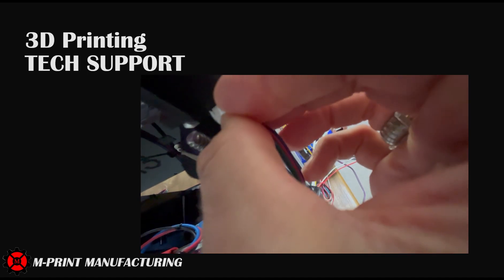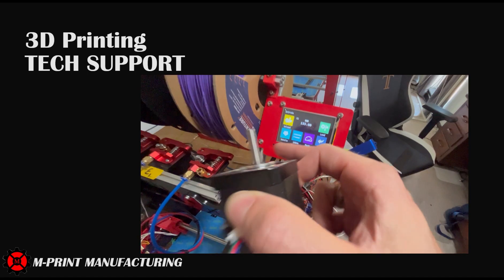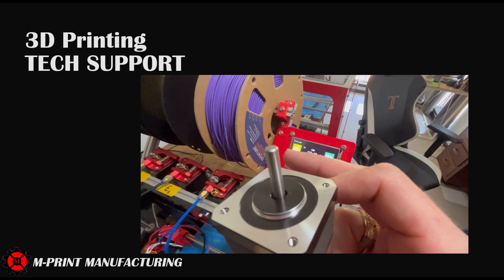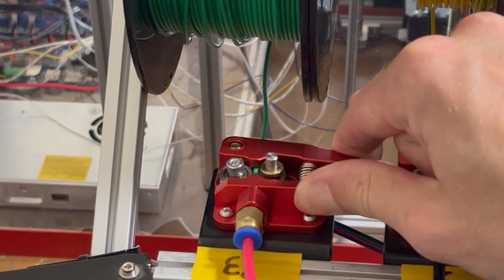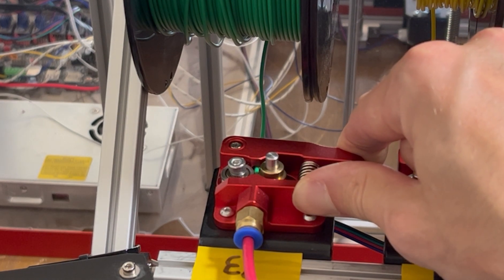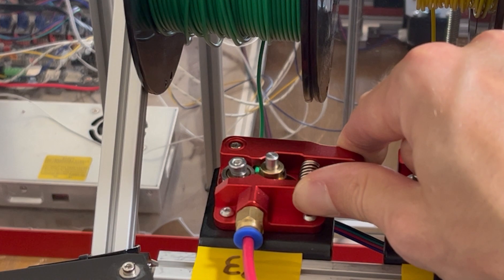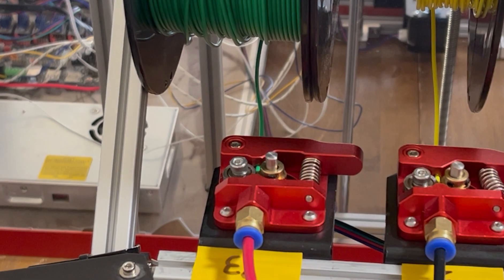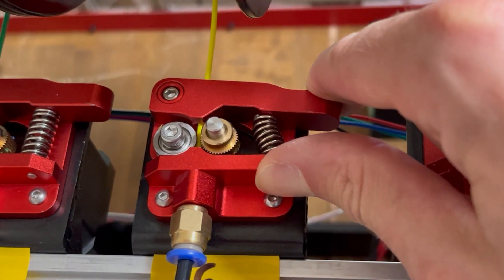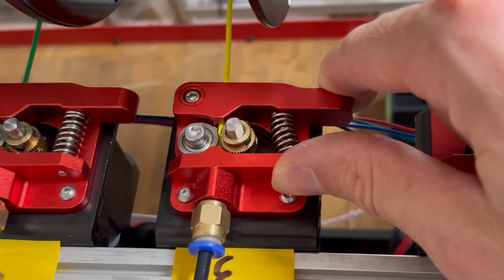Here's where I plugged in the new stepper motor into the controller — if it is a bad stepper motor, you can pretty much plug in the new one and it will work. I'm going to calibrate it to make sure the extruder is extruding the right amount of filament. If you're curious about setting up multiple extruders in Marlin 2.0, leave a comment and let me know and I can make some educational videos on this topic.